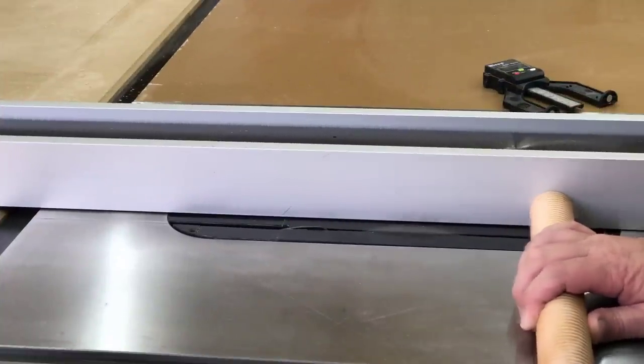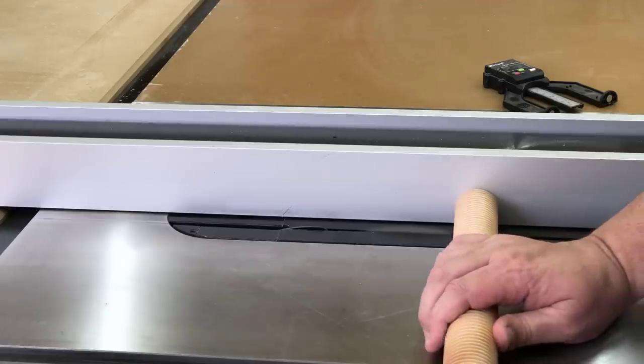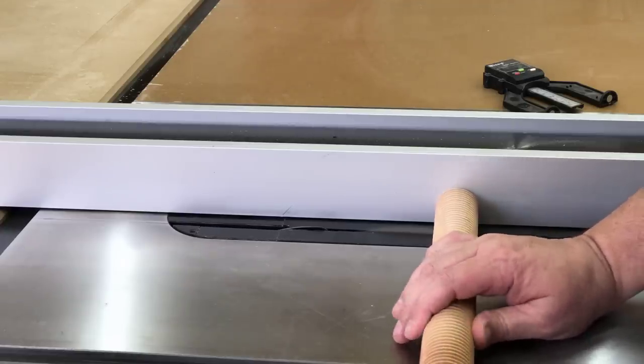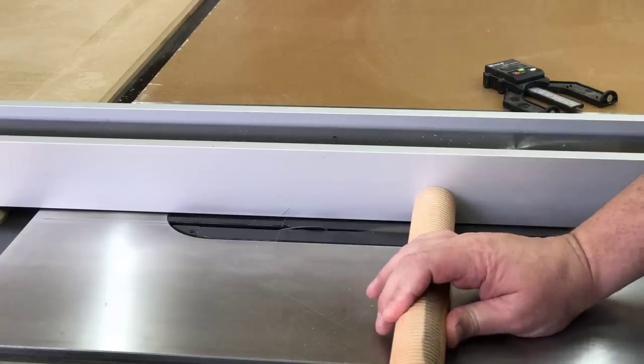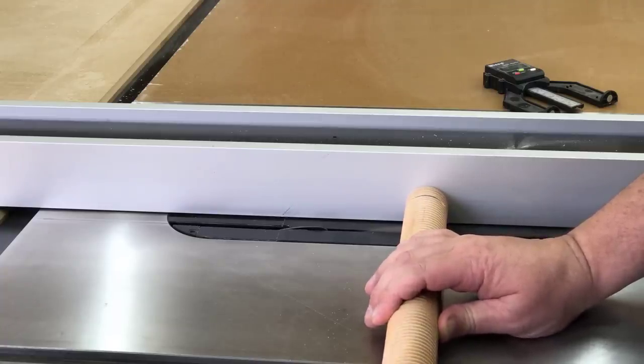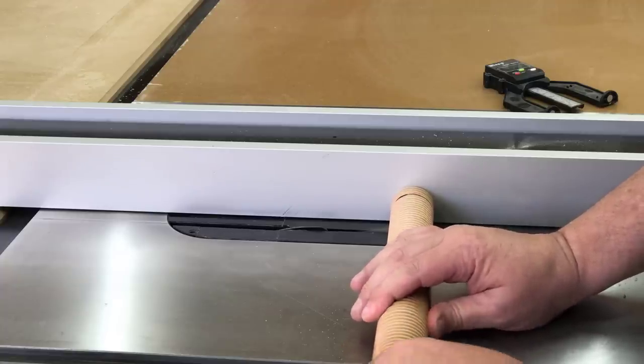So I've got to put a slot in the end of the wooden screw. It's going to be a point where the clamping pad can kind of hang onto and spin freely. When the screw gets screwed down into the object that you're clamping, you can't have the screw shaft turning against it because it's going to mar the wood. So it has to be sort of independent of the clamping pad, and you'll see how I put that together.